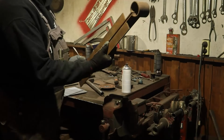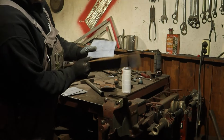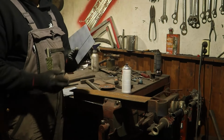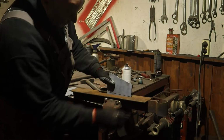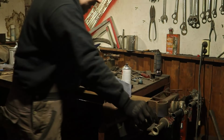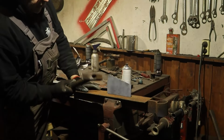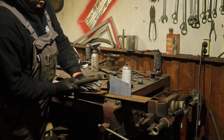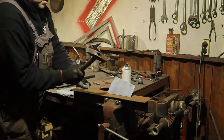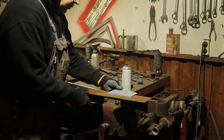So I have this tooling. It's 2 angle irons and a piece of tube, so you have sort of tweezers. If the material is longer than the vise, I can use it to clamp it on the entire width, and then it's hammering over. I will do it slowly. If I go on this side all at once, then I will have a bend in this piece. So that was the easy part.